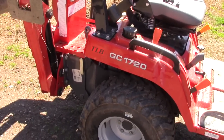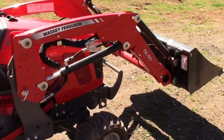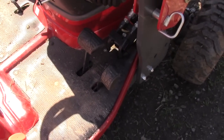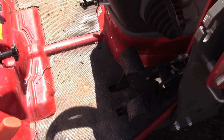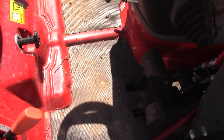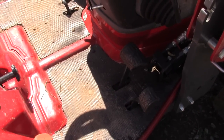This is a review of the Massey Ferguson GC1720 with a CB65 backhoe and a DL95 front end loader. I also have some other attachments that work with any three-point tractors that I'll go over in this video. The hydrostatic controls are over on your right side — it's really simple, forwards and reverse. It takes a little bit of getting used to, especially with your brake over on your left-hand side. You really don't need the brake a whole lot unless you're on hills, and you need to be careful on hills that you are using the brake and not putting any undue stress on the hydrostatic transmission.